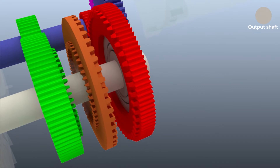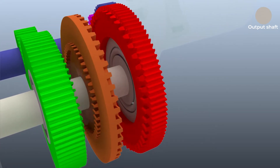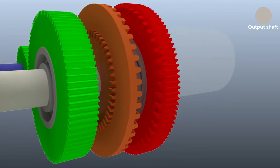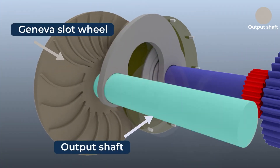These gears are independently engaged to the output shaft, each via a dog clutch. Dog clutches are ideal here since the speeds are already synchronized before they are engaged.